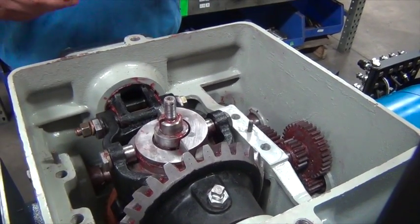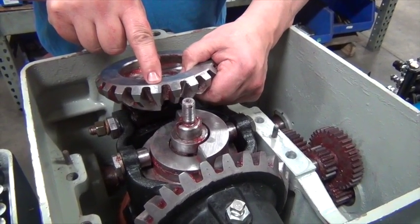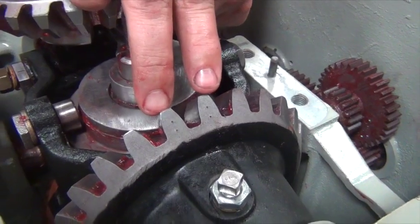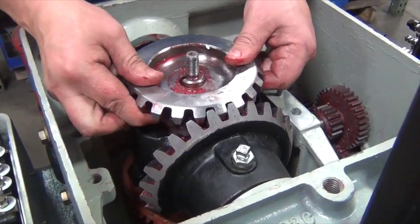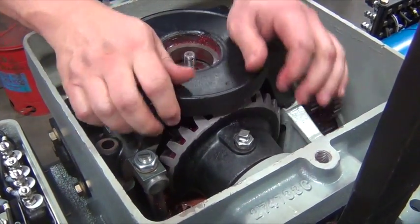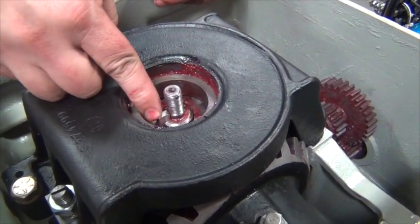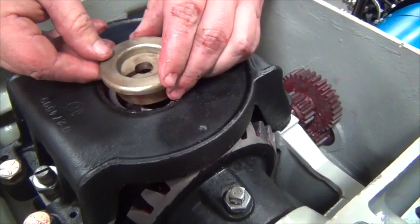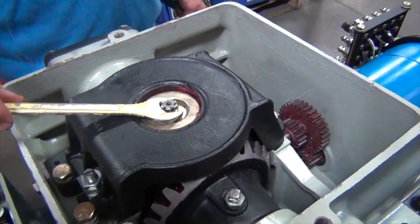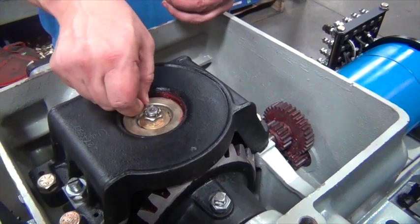Reinstall the spacer bevel side down. Reinstall the A or B gear. Note that the letter R or L is to be placed in between the two timing marks on the hand throw gear — this is critical to ensure proper timing of the machine. Use the letter R on a right-handed machine, the letter L on a left-handed machine. Install the bearing bracket in the machine, taking care to align the pins, and secure it with the four screws and lock washers that were removed. Next, reinstall the rectangular key and the bronze crank bushing and secure them with a flat washer and a castle nut. Use care to align the keyway with the rectangular key. Lightly tighten the castle nut, then back it off until the first hole aligns so that a cotter pin can be installed. Be sure to bend over the cotter pin.